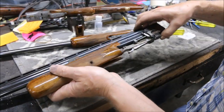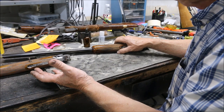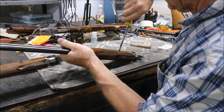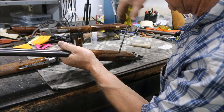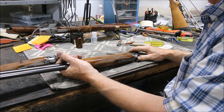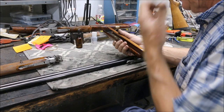The only fix, of course, is to replace it. That's the only way you repair salt. I've heard all this stuff about sealing, and you kind of can do that. We just use True Oil — dab it in there real thick, let it dry, hit it again the next day, get a couple coats in there. It'll seal them up if it's a mild case and buy you a little time, but it's not a fix. When I went to work at Browning in 1971, I was working on a lot of salt guns and at the time they didn't have salt-free wood to replace it with. So we were sealing — we'd repair the metal and then paint a sealer called Permathane into the inletting of the wood and put the salt wood back on. Well, that's a disaster looking for a place to happen. It's going to come back eventually.